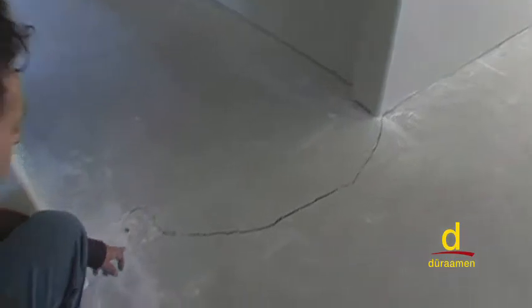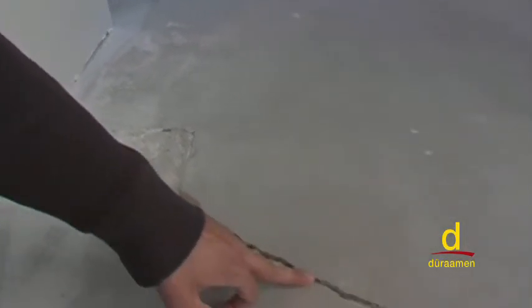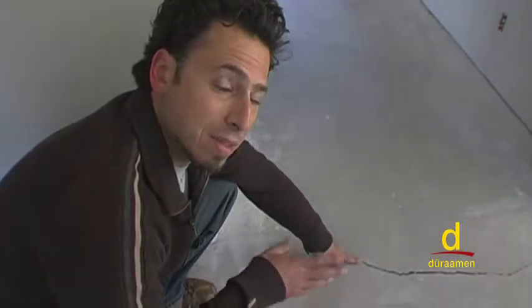As you can see here, the foundation is showing through, rebar and large separation cracks. These we're going to need to patch with fiber mesh tape, as well as some acrylic modified polymers, prior to doing our topping slab.